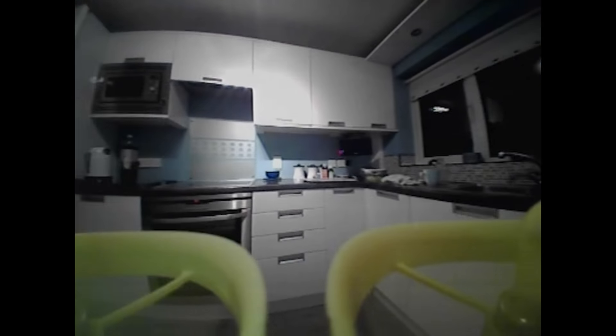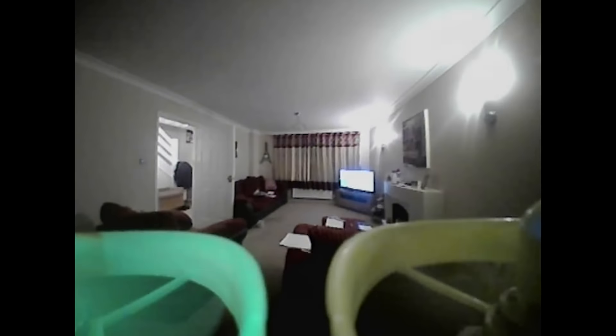Here's the DVR footage. The first thing I noticed is some slight noise bleeding through from the battery — you can see lines across the screen as I turn around and go through a door. It's not debilitating but it is definitely there, and it gets worse as you power up. I think that's the regulator on the camera not quite doing its job, as I didn't find this issue on the other QX series with the same battery.